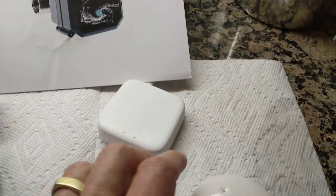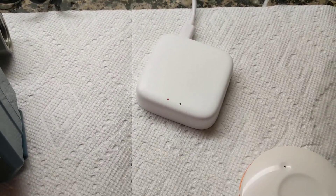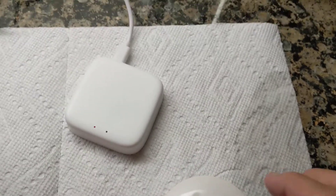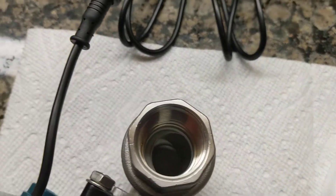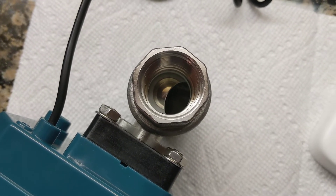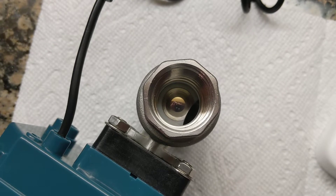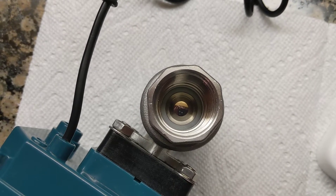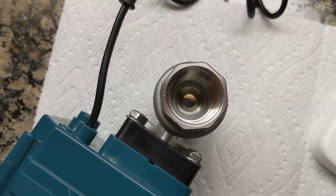The hub is connected to my Wi-Fi system here in the house, and it's using ZigBee. I have a little moist spot here on this paper towel, so I'll put this down on the sensor — and that's triggering it. The valve will now close automatically. The motion is slow. So it instantly detected the moisture and shuts the valve automatically by wireless communication, closing the valve down within about 5 to 10 seconds so your water is turned off in the house.